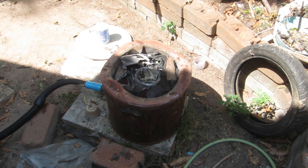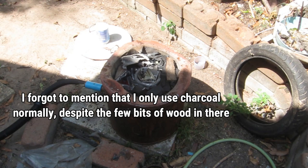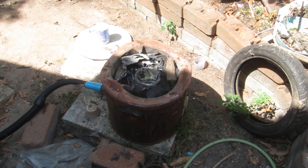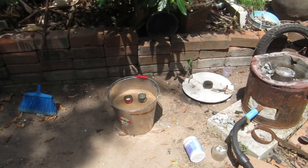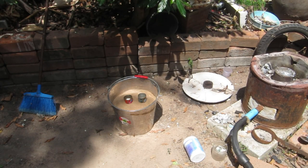For the benefit of my recent subscribers, this is my Thai barbecue that I use as a furnace. My crucible is in the center loaded up with all the offcuts from the extrusion I use for the doors. I use a vacuum cleaner as a blower. I've turned it off momentarily because it's a bit noisy. Once it's all well and truly alight I'll put the lid back on and start the process.